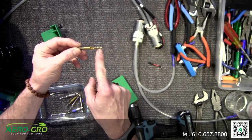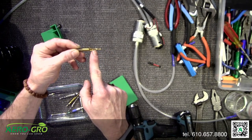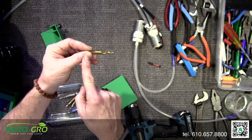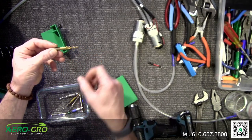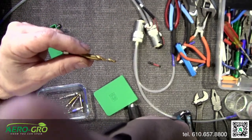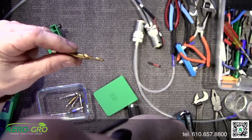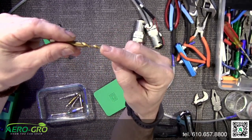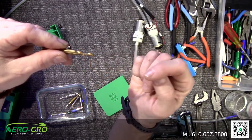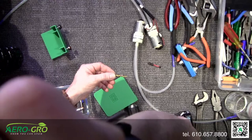The first part of this right here is a drill. It drills through the material. The second part has threads on it. So it drills through and then it starts to cut the threads. So drill, thread, thread, thread, pull it out, and you've got your threads. So, let's see if I can get that on camera. Is that showing up? Focus. There we go. So if you can see that, first part's a drill, second part's a tap, and then it creates your threaded holes, right?